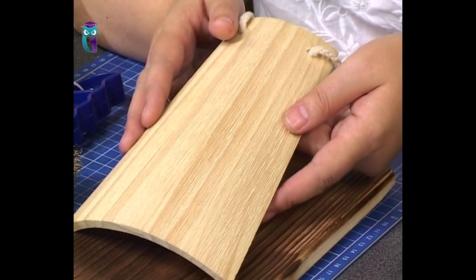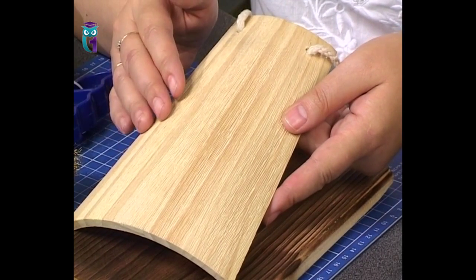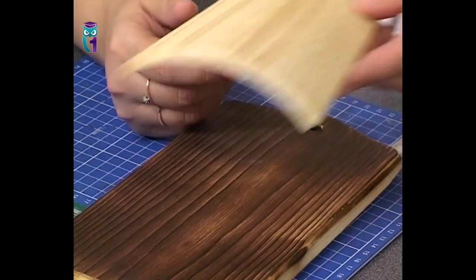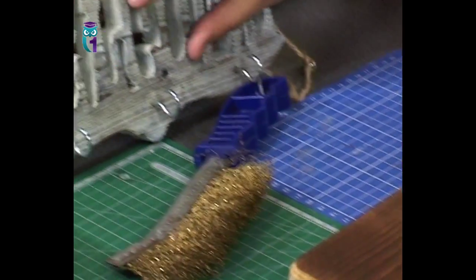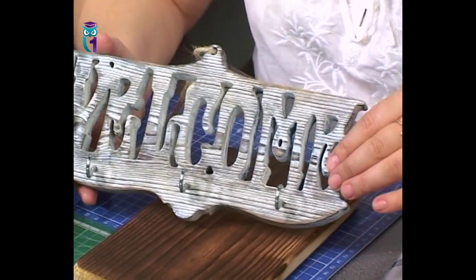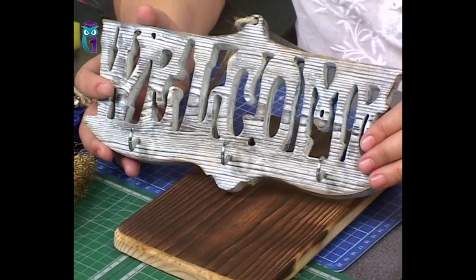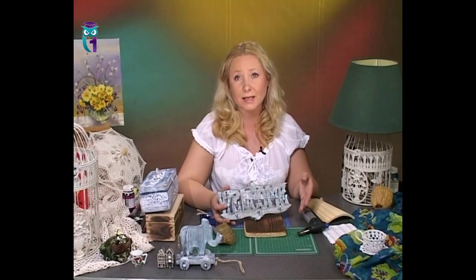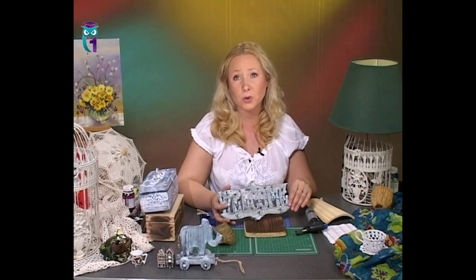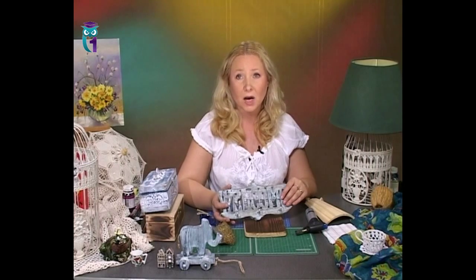Such processing looks good on massive floorboards, parquet, ladders, doors, furniture and other home decoration from wood. Breeds of wood with strongly shown hard and soft growth rings, for example oak, ash, larch, fir or pine, lend themselves to brushing best of all. Brushing isn't applied to beech, maple, pear, alder, cherry and teak.